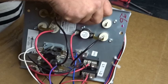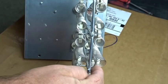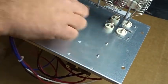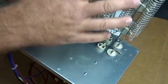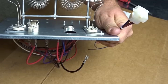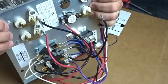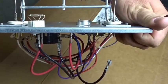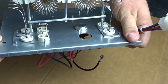Let's look at the back of this heat strip. There are two elements — you see one row here and another element here, and you can see the connections down here at the base. The current enters here, exits here, travels through this entire element, and exits here. The resistance on the element causes them to heat up — that's where you get your heat. Same thing on the opposite side: a pathway through here, electricity back to here. Once it exits, it'll travel through this jumper and go through the one-time fuse, which is here. Each row has a one-time fuse. Some of those you can replace — a lot of them you can — depending on if they have them in stock, or you just replace the entire heat kit depending on the cost.